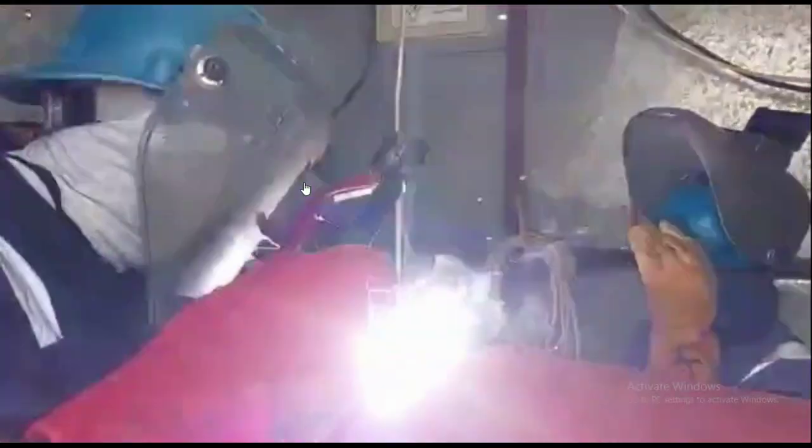You can see how the feeding of the filler metal is done. This is the visual inspection of the welding after finishing the hot pass. You need to do a visual check to see if any defect is there or not — if there is any porosity or not — and to remove that. After that, you have to check the NDT LP (liquid penetrant) detail before starting the next pass.